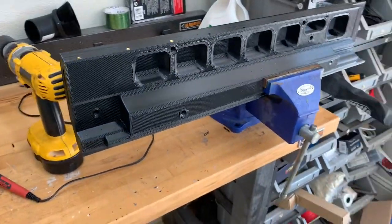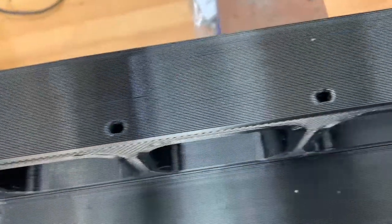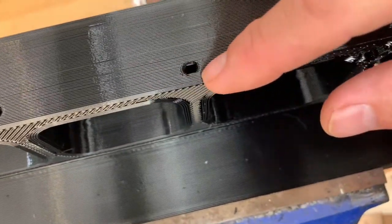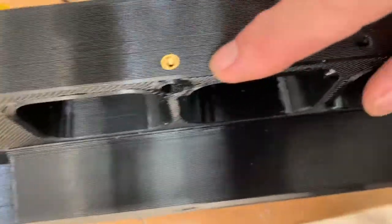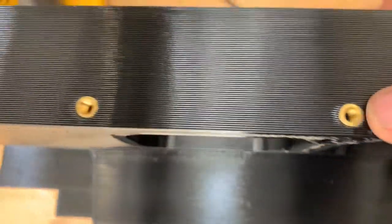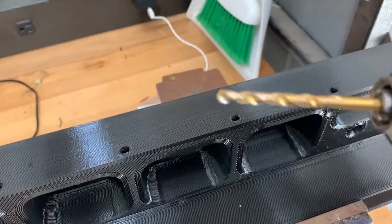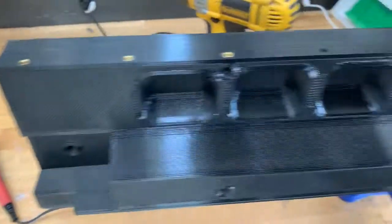The first thing you're going to want to do is take a drill and look down at your holes to see if you've got any material left over that you need to drill out. If the holes are too thin, there's excess material, or they're too shallow, that material is going to seep up into the actual threaded insert. There's just a touch at the very bottom here, but from experience I know I'm not going to have any problems with screws because I've got plenty of room.